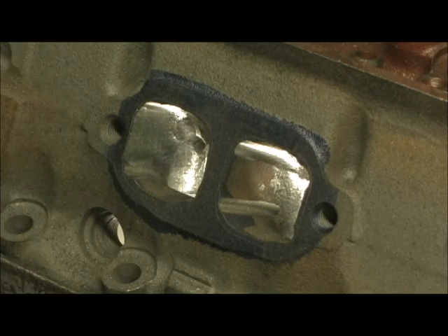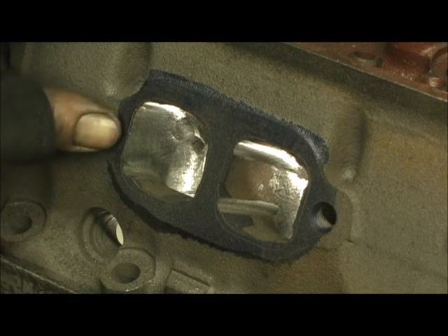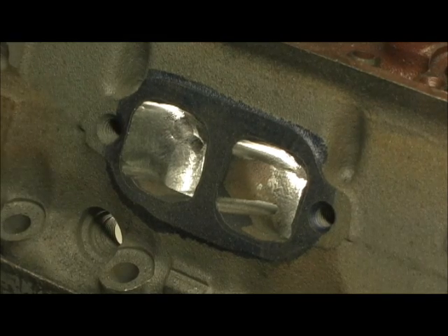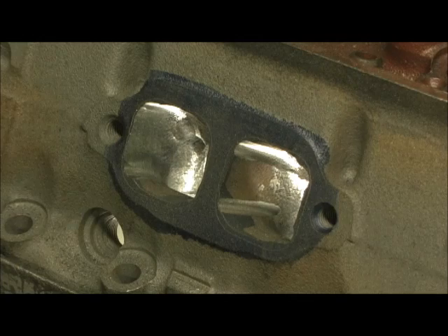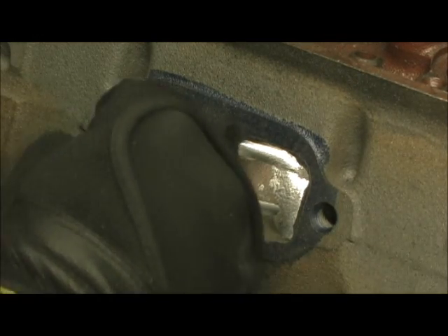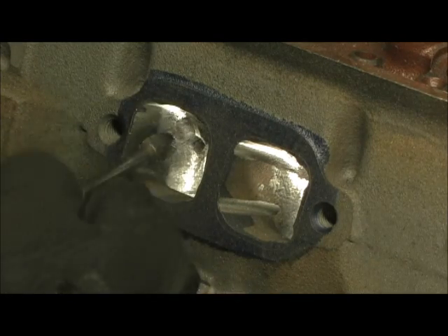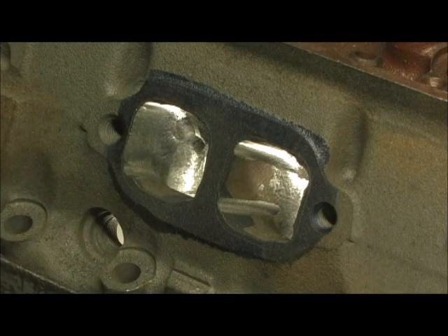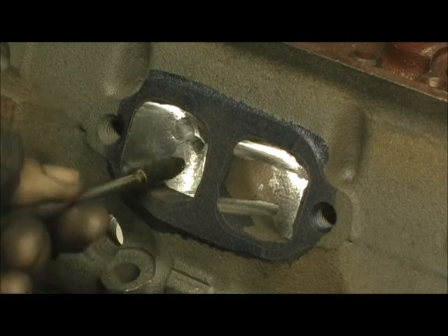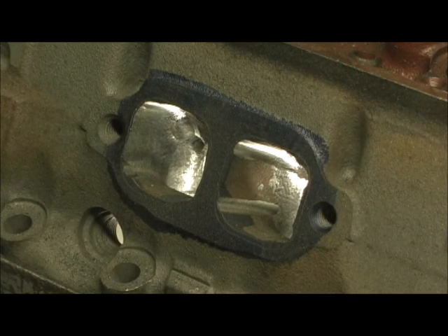With most of the meat gone, I'll stop a few thousandths short of bringing it to the line, because I'm going to switch to the baby egg to go in there and pull that in and roll the trench radius up into it when I'm done. That's my digger that starts to form the shape, then in the very end I'll switch back to pull in the final shape and make it roll right into it.